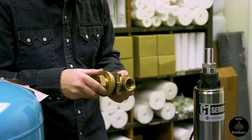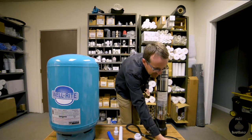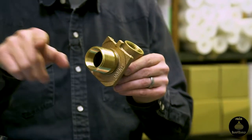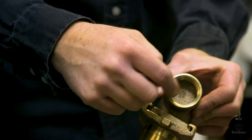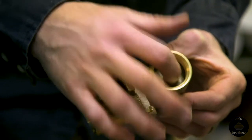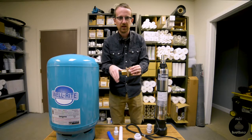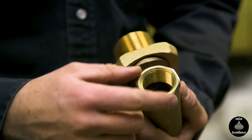There's this flange fitting — these are all components useful for a watertight seal on a well casing, but we do not need these for a cistern application. Instead, we just need this two-part component. This is the side that will continue the water line to the house — the house side of the pitless adapter. There's one-inch female threads in here, but if you put your finger in, it stops right there. That side faces ground level; it will face you if you're looking into the cistern.